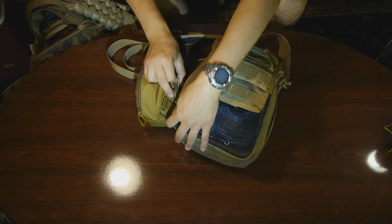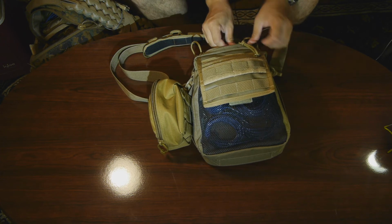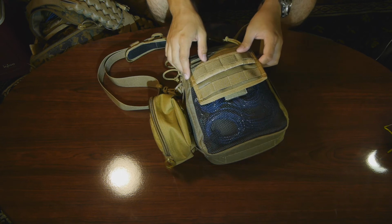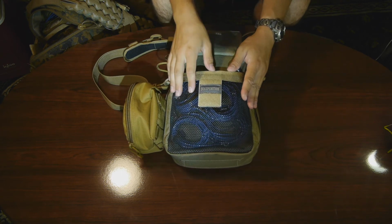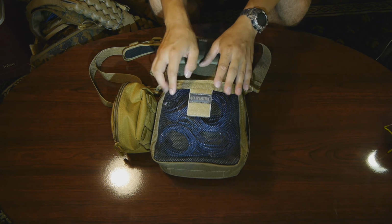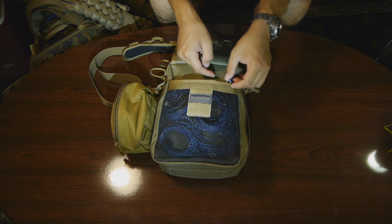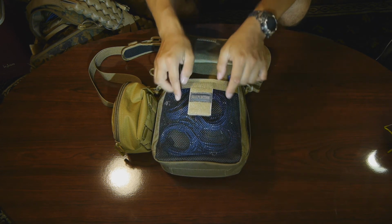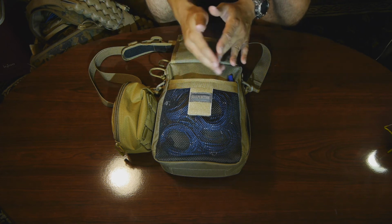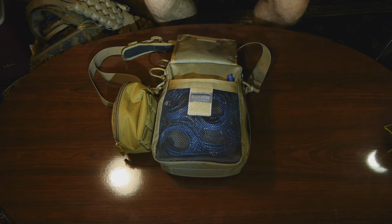This is my Summits on the Air kit. It's not as lightweight as other kits that other guys use, which is fine, but it is rugged and it does last a while. On the front here, we have the elements for the dipole. I made a linked dipole. I have 2 elements for the 20 meter, and they connect via these ring terminals with the wing nut screws, and then I have 2 more elements which extend out further to make a 40 meter dipole. So I can be on 20 or 40 with the dipole, or I can connect all 4 of them.